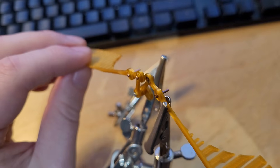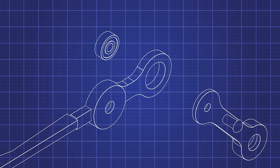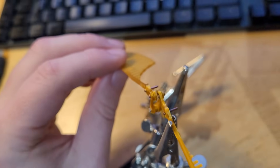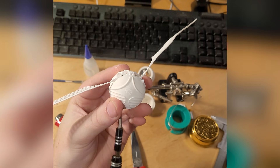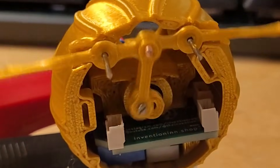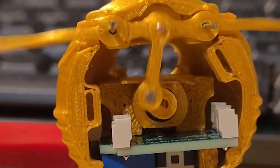The most difficult part was this tiny overlapping joint right here. I only had about a millimeter of space between the two wings. So I used miniature rivets and hammered them flat. These flattened heads face each other, which lets the wings overlap and move freely without touching. This was a huge improvement over the previous version, where all the hinge points were plastic and kept breaking. I then tried to make my own brass rivets, but I just couldn't get it to work reliably. This is where I almost gave up the entire project — I could not find an axle small enough that was able to stay in place. The bearings and copper rivets worked wonders. The total thickness of the mechanism is about 5 millimeters, which is ridiculously small and pretty compact for a flapping mechanism.